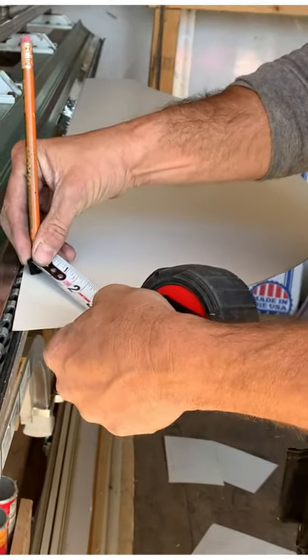We're going to dry fit our keystone, make sure everything's good, trim as necessary. Then we're just going to put really big beads of caulk in there so it adheres — we're not putting any nails in it. We just have that one nail right there. We're centering this. That line under the bottom wasn't quite as centered as my keystone is, but that's okay.